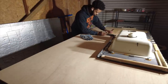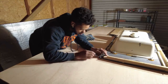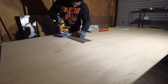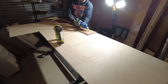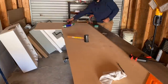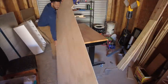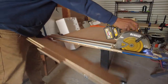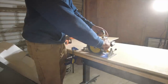Here you see me tracing the shape of the old countertop onto a piece of plywood. I'm changing up the way I normally make countertops — I usually use solid wood, but that gets heavy and time-consuming to glue up panels. This time I opted to use laminate flooring as the countertop. It's very lightweight and much faster. I set a deadline for myself that I'm already past, so I glued the flooring onto plywood and cut it to shape. It came out really well — I just need to put a border on the ends so you can't see where the plywood meets the laminate.